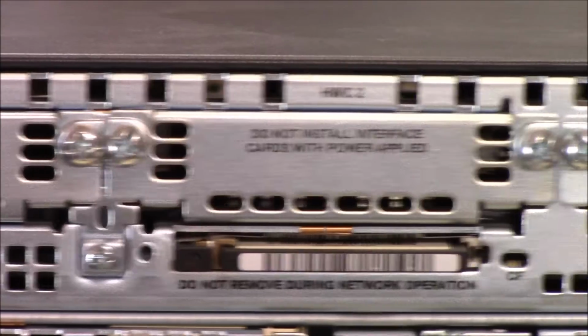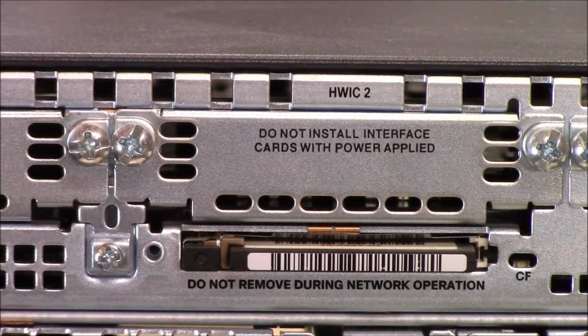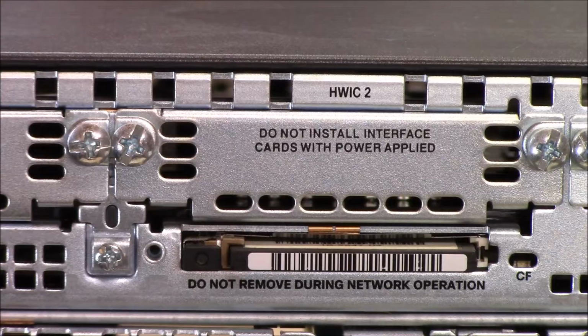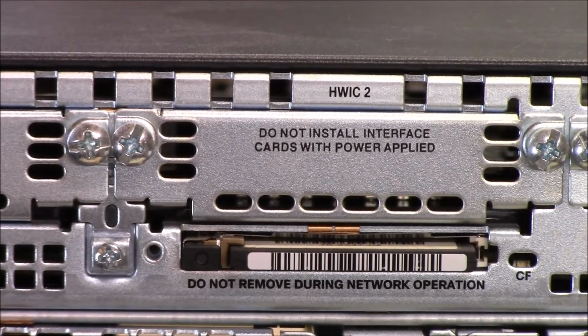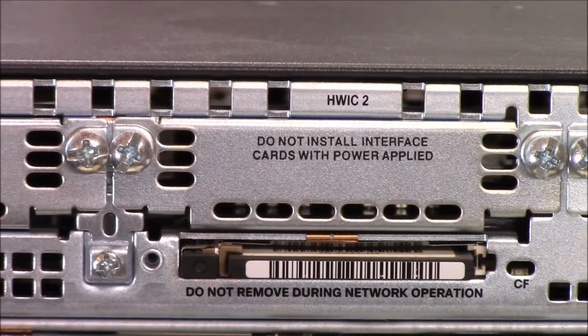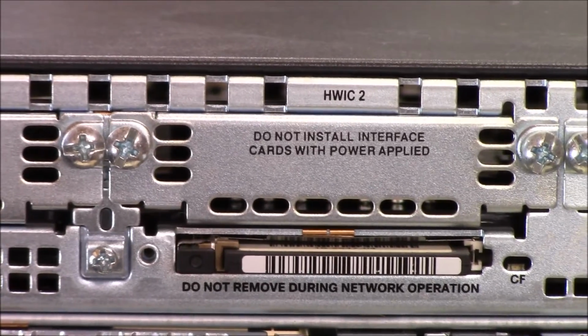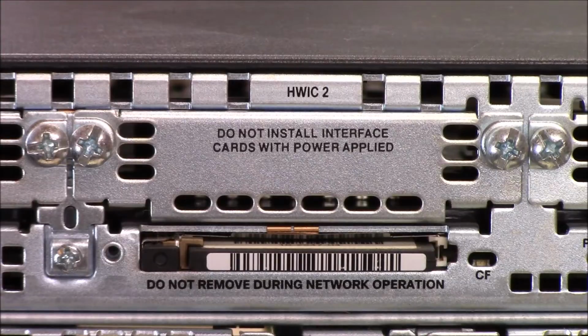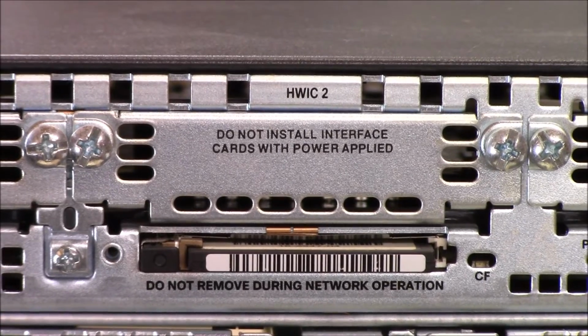And one of the things that I mentioned the other day, but I'll mention it again because it's important, is when you buy stuff like this, make sure it's got all the blanks in it. You don't want to buy something that looks like it's been stripped down and dumped onto the side of the road like an old abandoned car, because it serves a purpose, and one of the main purposes, besides electromagnetic interference, is it helps with the cooling. Otherwise, these things won't cool properly, and so anyway, I just thought I'd bring that up.